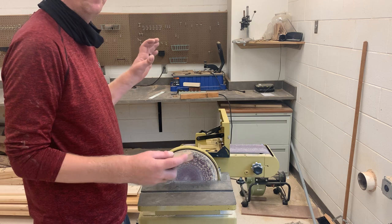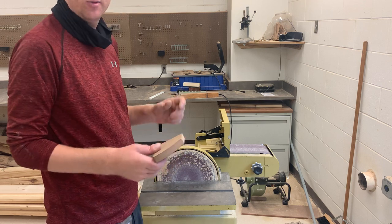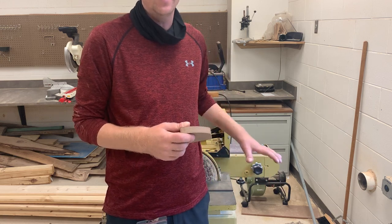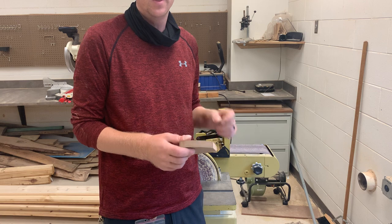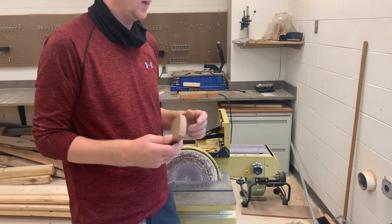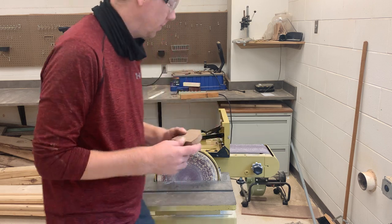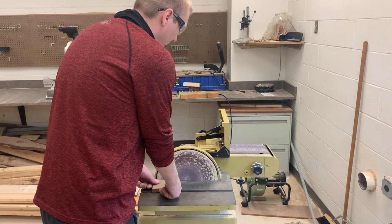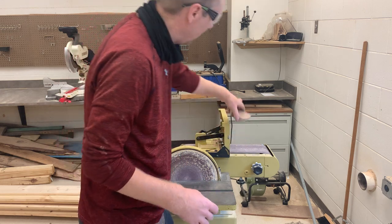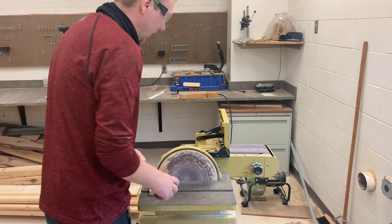A couple of rules: make sure the machine is at its full speed before you start using it. Secondly, keep your fingers about an inch away from any of the sanders. Although this machine doesn't look very dangerous because it doesn't have blades, it's actually one of the more dangerous machines — it will take off parts of your skin within seconds if you touch it. If it can rapidly take off wood, it can rapidly take off skin on your fingers. Also, keep your wood pieces flat on the table. If you curve them or try to lift them up, the wood could kick back.